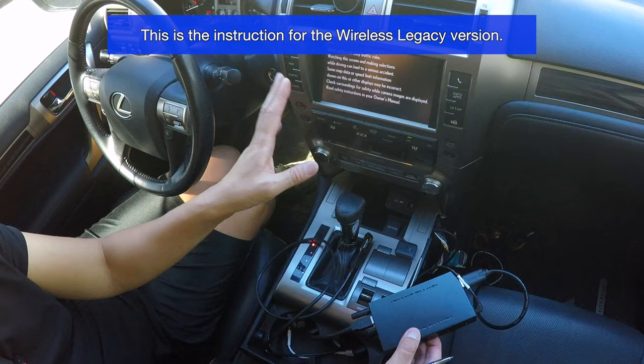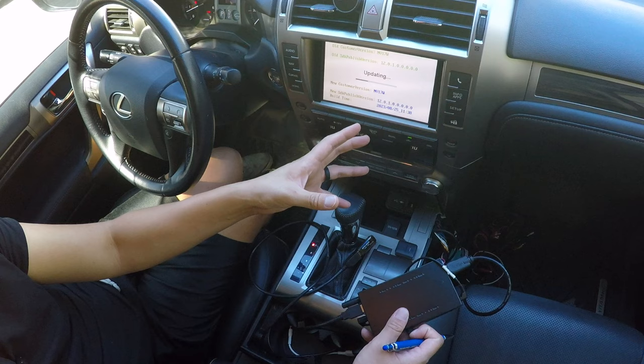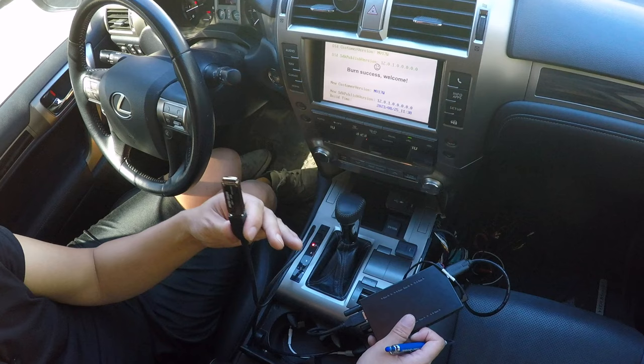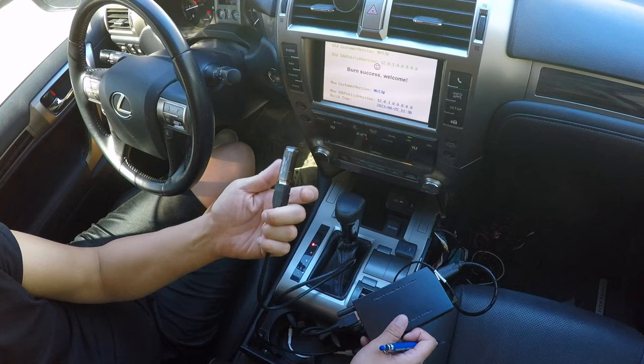If you keep the button pressed too long you'll see red crosses on the screen — that's something you don't want. Turn on your CarPlay and you'll find a screen that says 'Updating.' Some issues you might encounter: if the update fails, try another USB thumb drive as some drives just don't work. Also make sure you unzipped the file and included both files in the root folder.